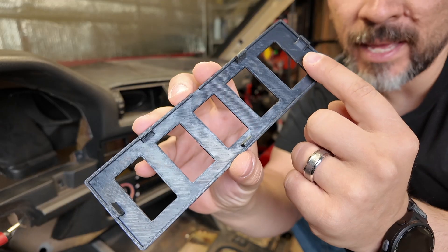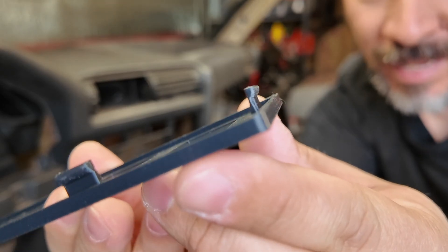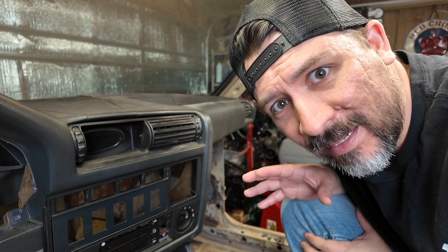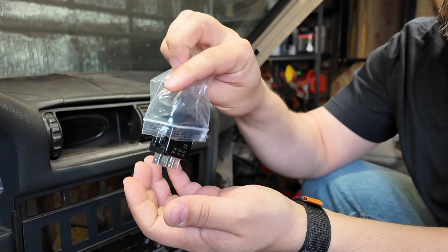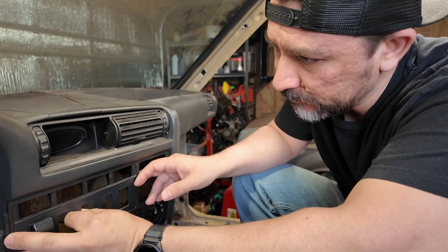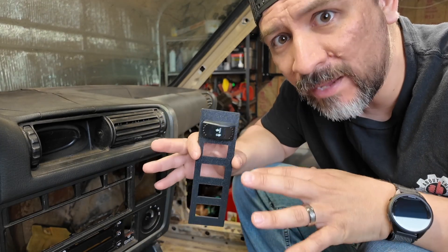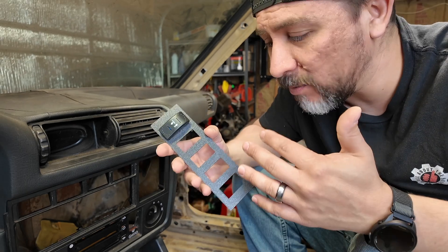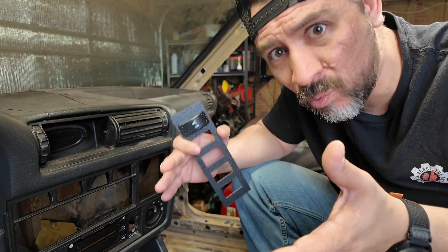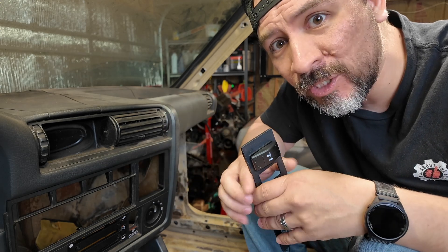And here's our part. We actually added a couple more clips, and here you can get a pretty good picture of how our little clip came out. Let's see how everything fits. So let's see how one of the switches fits into our pre-cut hole. The part came out pretty well, but you're going to want to make sure that you use the right filament if you decide to 3D print this part yourself. This part is printed with UV-resistant filament that can handle up to 220 degrees Fahrenheit. If you want to learn to print filament like this ASA, watch this next video here.